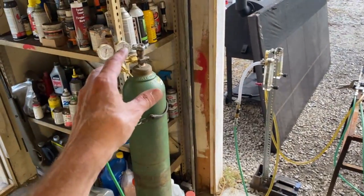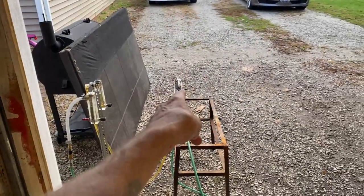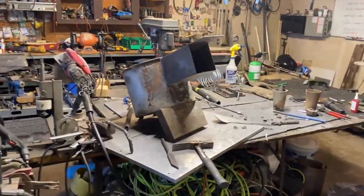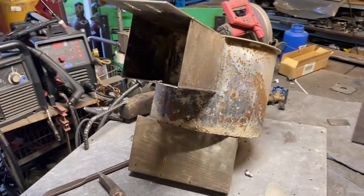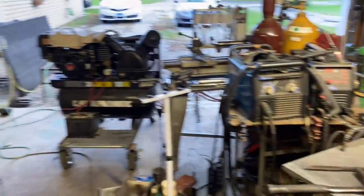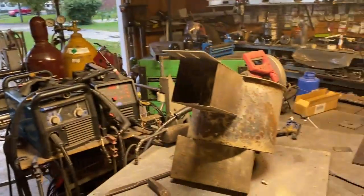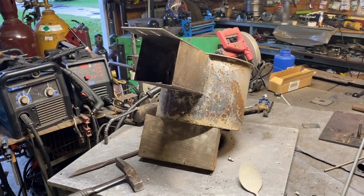The strategy here is to only turn on the oxygen the moment that the foundry furnace has achieved a temperature of 2,650 degrees Fahrenheit, because that is the maximum temperature obtainable by standard air compressor burners, even with one as sophisticated as the Godzilla burner with the preheat line. You can get about 50 degrees hotter than that with propane — but we're going to be using diesel.